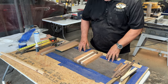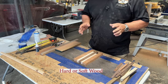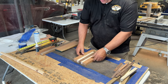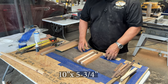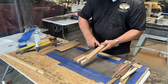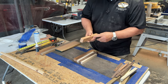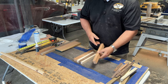The first thing you want to do is make sure that you have all your wood picked out for what you want to build your little board with, and make sure that it's all planed and jointed down to the correct size. I've jointed this, got it nice and smooth, and I've planed it on the surface. Everything I'm working with here is three quarters of an inch thick — that's what you want to work with, at least three quarters of an inch.